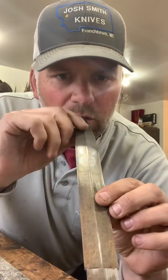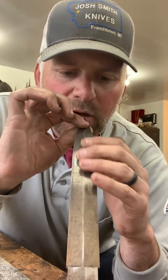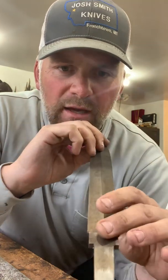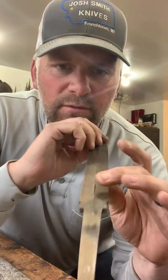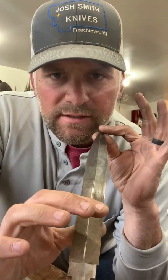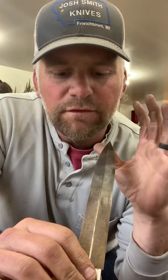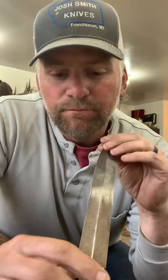As I explained in that earlier video, when I grind a dagger, I left this flat all the way down the center here. I didn't grind it to a perfect ridge line just yet. I have a nice flat here, a nice flat on my tang and handle, and a nice flat down here. So what I'm going to do is put this on the surface grinder and take out those little imperfections. I left this blade just a few thousandths thick for this exact reason. I always like to do a little bit of a surface grind on my blades that require flats after heat treat just to clean them up, so when I go into my finish grind I'm working on perfect flat and true surfaces.